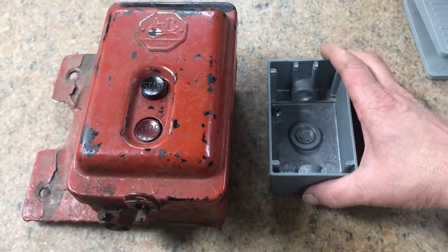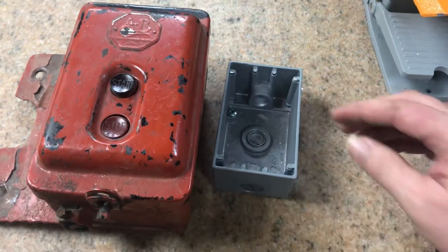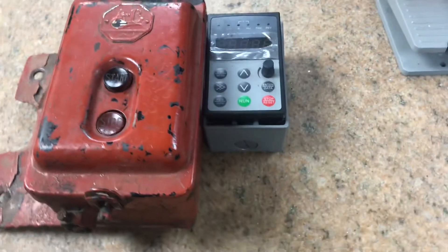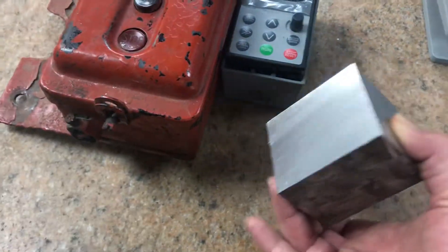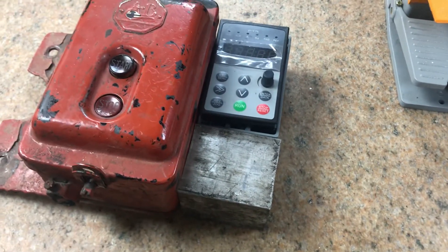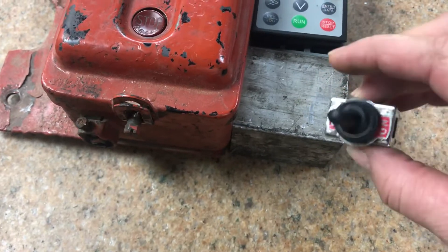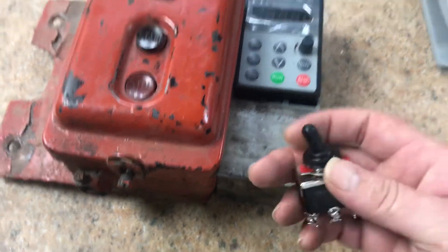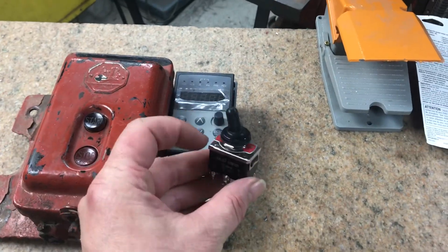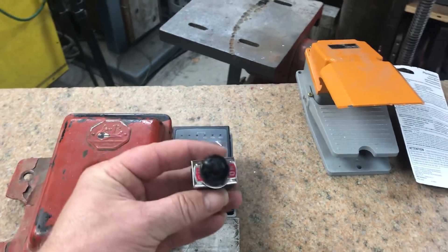Next to the starter I'm going to mount this little watertight electrical box. I've got to cut these little posts down a bit because I want to sink the VFD display in there. I also have this chunk of aluminum I need to clean up a bit — I'm going to mount that right here and then put a little tiny toggle switch. This particular toggle switch is an on-on switch — not a three-way — it's on one way or on the other way, so I'm going to use it as a forward/reverse switch.